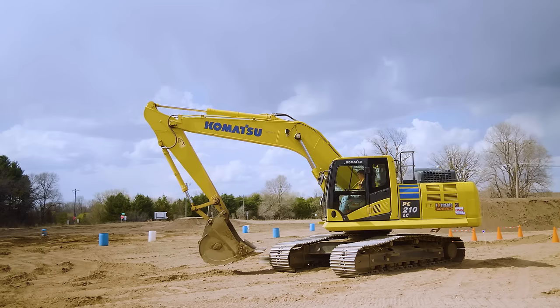There's a couple reasons you want to dig with that in the rear. One, that's your most expensive part, the drive motors in the back. So if you were to do any damage, you'd want to protect it. That's why it's in the back. The second is just from a counterweight perspective. You have the counterweight on the machine, but if you add the weight from those drive motors, you've all got the weight in the back there. So that's generally what I will advocate for. It's not going to be the solution every single time, but if you can control it, to me, that's the best.